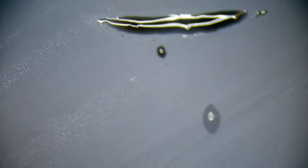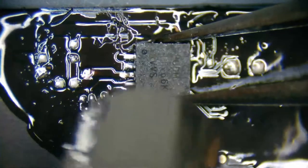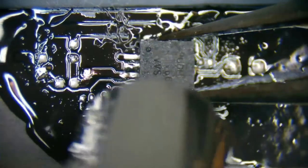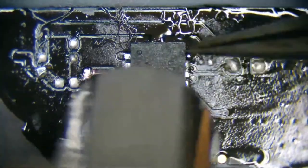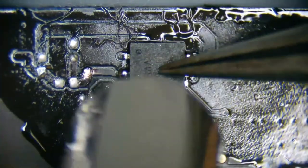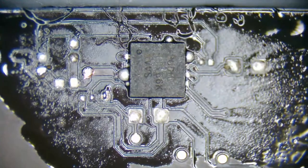In one crazy instance, I actually had an A1706 not turn on because there was a tiny, tiny little tear in the touch bar flex. The computer would turn on if it wasn't in its housing, but once I put everything back together, it wouldn't turn on anymore. I don't know if you're getting the 10 milliamps when it's outside of the housing, but I've seen that to be all sorts of random issues.